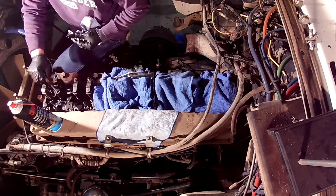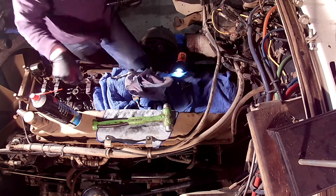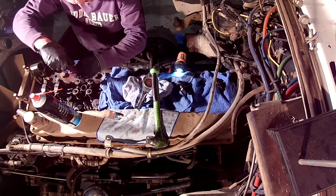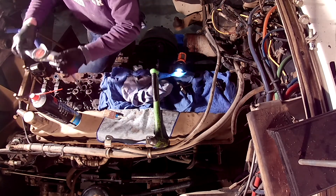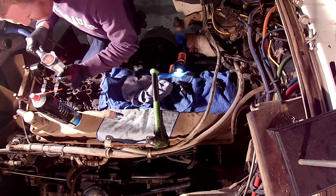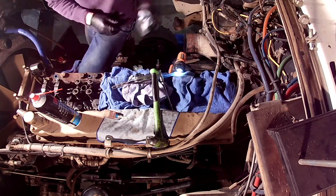The exhaust is being updated to a newer style pulse exhaust manifold. The original part number 3801322 exhaust manifold used sealing rings between the end and center sections. Through the years the sealing rings commonly failed due to repeated heat exposure cycles, causing exhaust leaks. The new 3801915 exhaust system was designed to replace the original style manifold offering a longer lasting solution with a machine slip fit connection and no sealing rings.